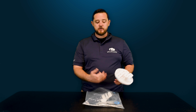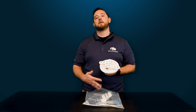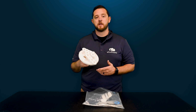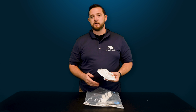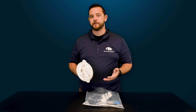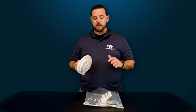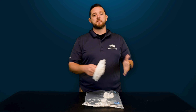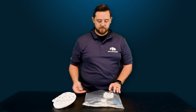The only difference is when you're actually getting into your impellers and your cams. If you guys don't have those in good condition, you're going to either have to purchase those separately or go ahead and just exchange or swap out your gear kit to get the right one. So again, the most popular one for this one is the 2" just because with traditional plumbing now you're dealing with 2", but for a lot of other pools, older pools, 1.5" line was very popular. So obviously the cam has changed to make sure that it attributes to those different sizes in the actual piping for you guys. So here's your low profile gear kit. Set that off to the side.